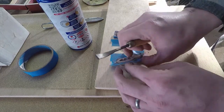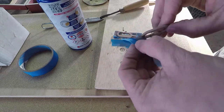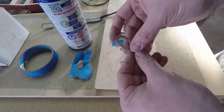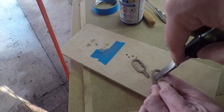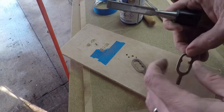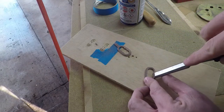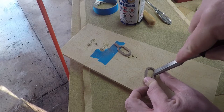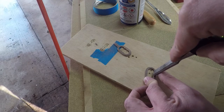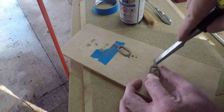I used a flat gouge to wedge in between the pieces of tape to get them off the waste board — it worked pretty well. Then, using a really sharp chisel, I had to get rid of the excess wood on the inside of the ring. I made sure to flip the piece over and go from both sides to prevent tear-out. As you can see, I've been making two of each piece because I did not trust myself enough to make just one perfect.